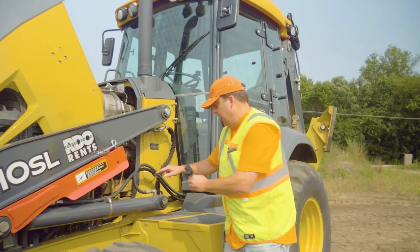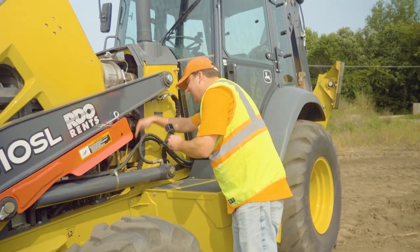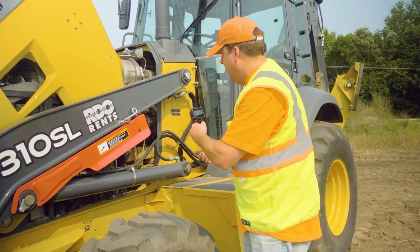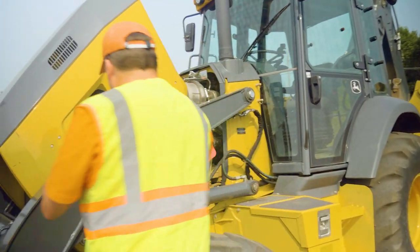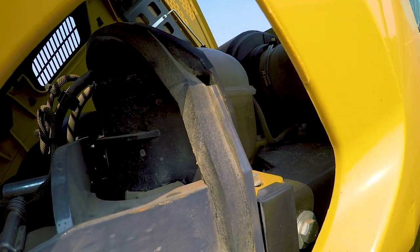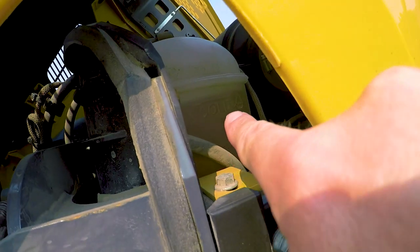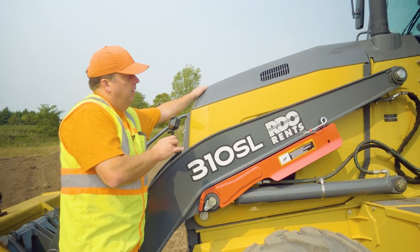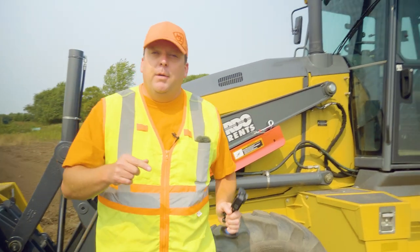I can also see my radiator fan in here — looking at the back of it to see if there's any damage. Checking both sides and looking in to see if I see any damage, anything loose, anything that just sticks out. I don't need to be a diesel mechanic to say that doesn't look right. On the John Deere's, if you push this down a little bit, you can actually see the coolant level marker — that's how you check the coolant, which is obviously very important. And that was the finish of the compartment check.